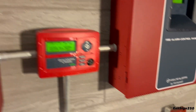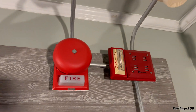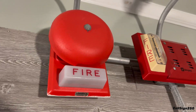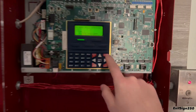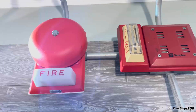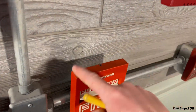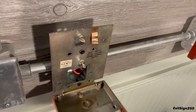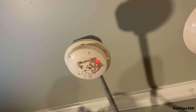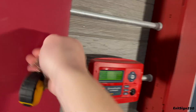In the meantime, let's activate the Honeywell pull station. Audible silence as well, and that strobe is very dim. To reset this pull station you get a tiny flat head screwdriver, stick it on top — it opens up — then flip the switch up and close it. It's back to normal. I think the heat detector has cooled down, so we'll reset both systems now using the annunciator. That chirped for a second — that was weird.